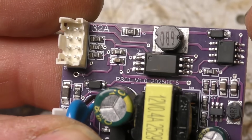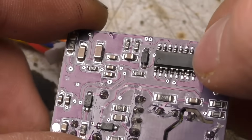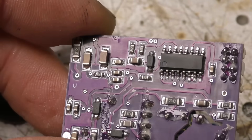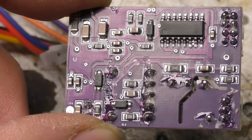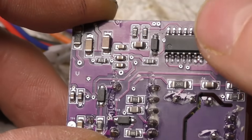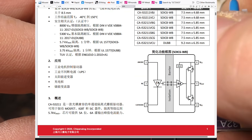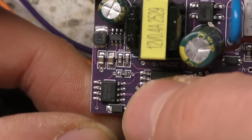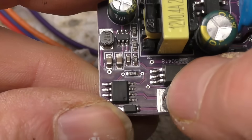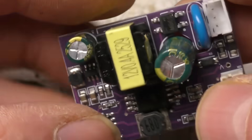The 34063 will be generating probably a 5V or maybe 3.3V supply for the micro. This is an 8H1K08 STC micro — I'm surprised they've even used a 16-pin package because all this needs to do is generate the PWM signal corresponding to the 32A current limit, plus a little bit of sensing to drive the LED. Very little is needed here. Interestingly, they've used an opto-isolated gate driver to generate the PWM signal, which is a bipolar signal. Although as I say, they're not making use of the isolation because the PWM signal is referenced to mains earth — this might just be a convenient way of generating that bipolar signal with an off-the-shelf part. The build quality looks okay but there are definite failings in the isolation distance.